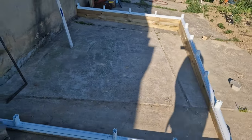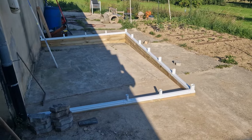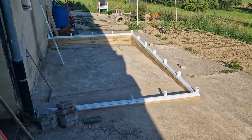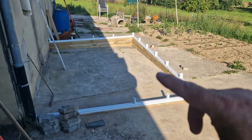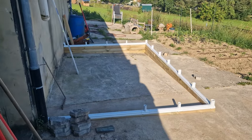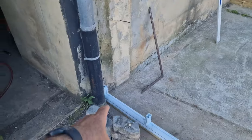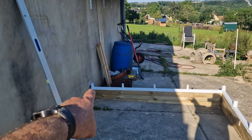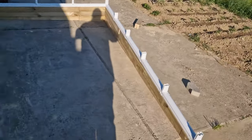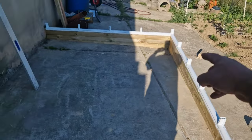So the plan is to stop in tomorrow for lunch, maybe throw some paint, come home, zing the anchors, and actually start the actual assembly of the greenhouse. But what I need to do is anchor this corner right there, then do a measurement out to that corner and anchor that corner, make sure that this is sitting at the right spot, and then just get it all anchored down. It sounds easy in theory, right?